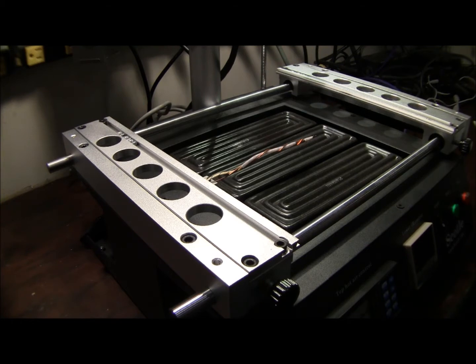Our profiles are all about creating a perfect three-phase profile covering preheat, soak, and reflow zone. A proper preheat heats up your board so you avoid thermal shock. A proper soak ensures your flux activates properly and is most effective, and then you have a proper reflow.